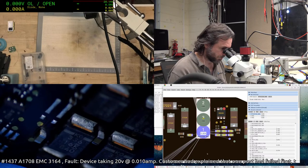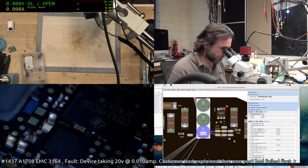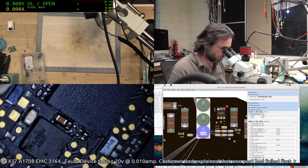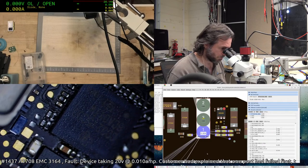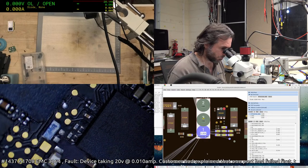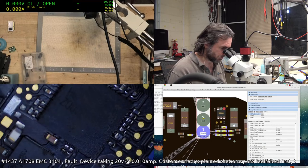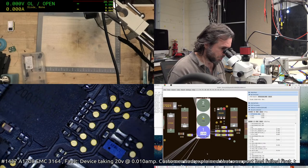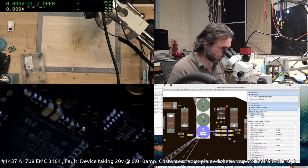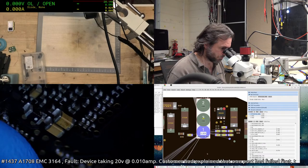I'm hoping my LED ring lights will turn up soon. Well, the circuit boards for the rings. I'm hoping I'll be able to get away with the 8 LED version, but I have a suspicion I'm going to need the 16 version. If I do need the 16 version, I don't know whether I'm going to go with them being driven by the one driver, which can do it. The driver is capable of 350 milliamp and I'm only going to be driving these at about 120 milliamps each. So yeah, I can do 240 with these.